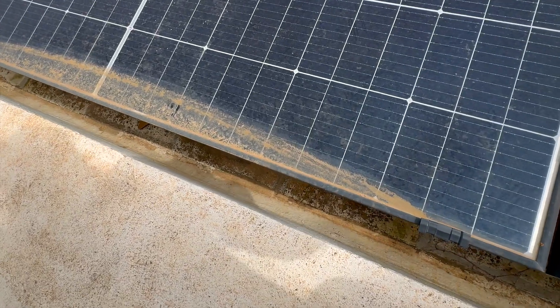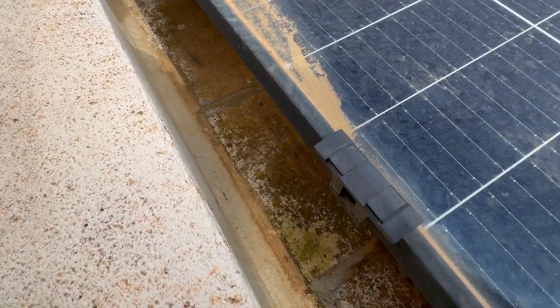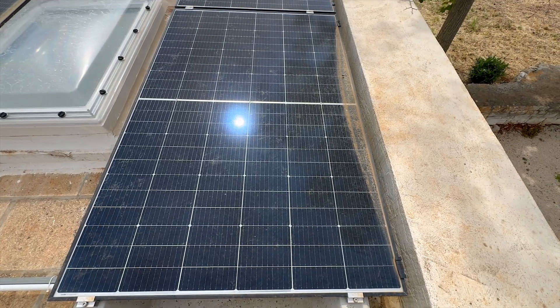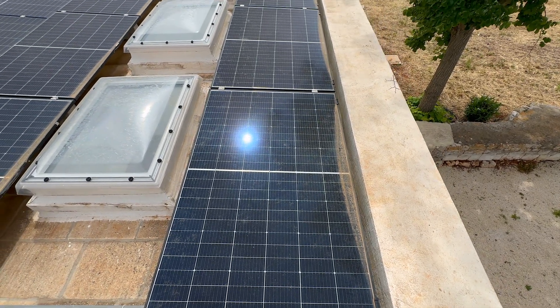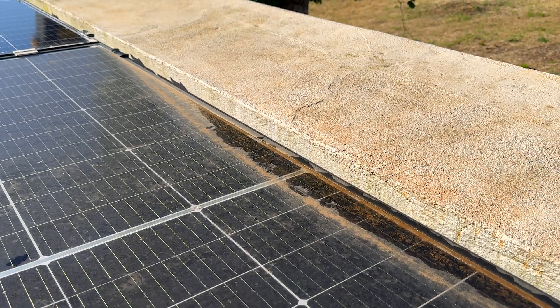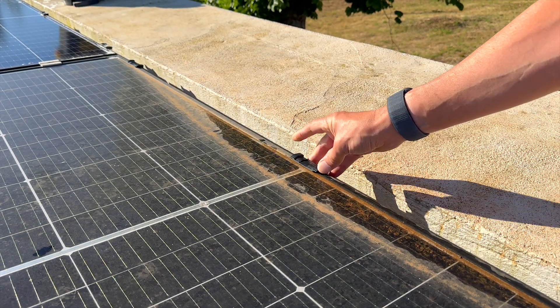The story with the landscape-oriented panels is a bit different. You can clearly see that the drains have done their job — there's noticeably less dirt in the areas around where the clips are installed. However, there's still significant dirt accumulation in the middle of the panels. This tells me there's likely a slight dip in the panel's level, probably caused by how it's supported. As a result, water tends to collect in the center. In hindsight, I should have installed a drain clip in the middle of the panel, away from the mounting brackets, to help water drain from that low point.